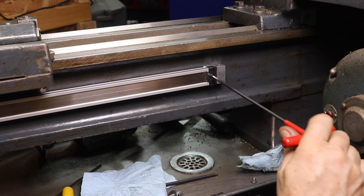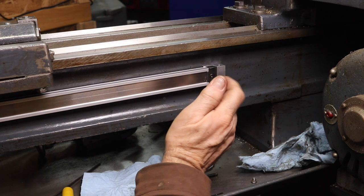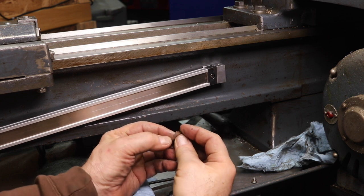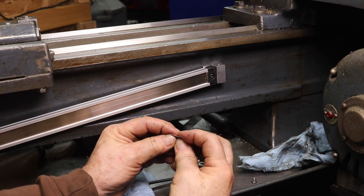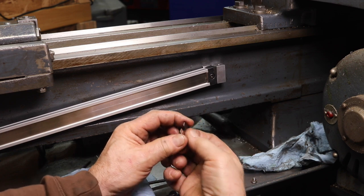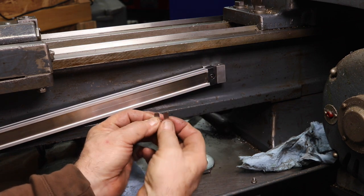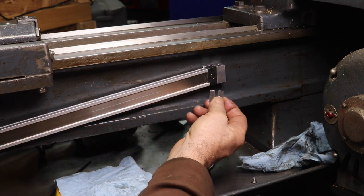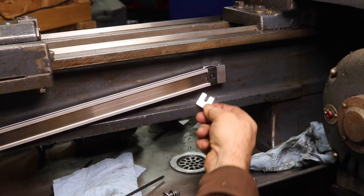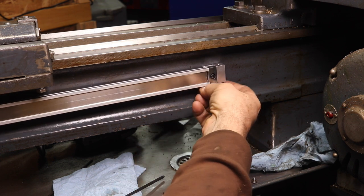You have to allow for adjustment, otherwise you're not going to drill them super accurately. I ended up with three little shims — probably about 15 thousandths total, each about five thousandths. These shims actually came with the kit; it's the only place I used them. It was a little bit of a pain but I put them in behind the scale itself — that was the easiest place.